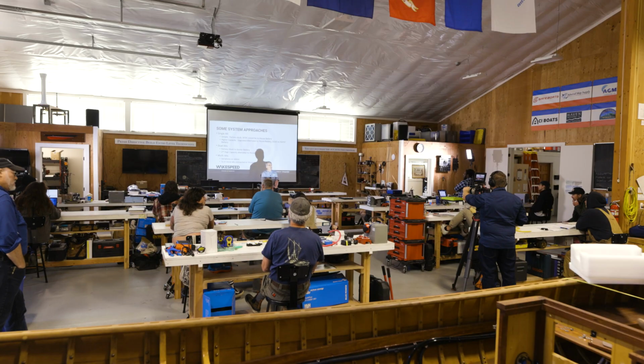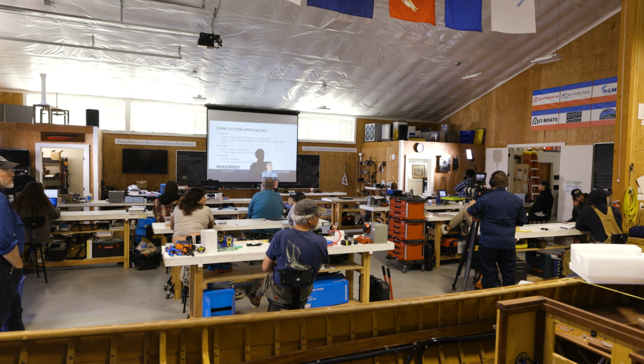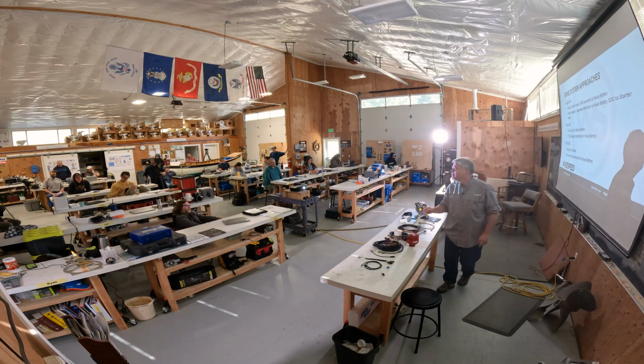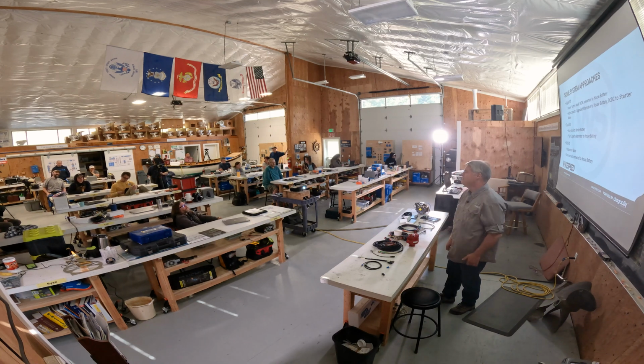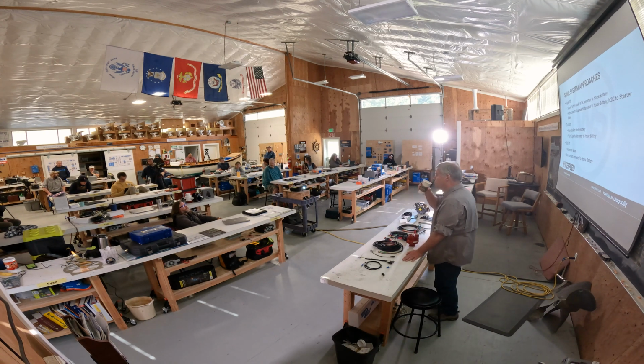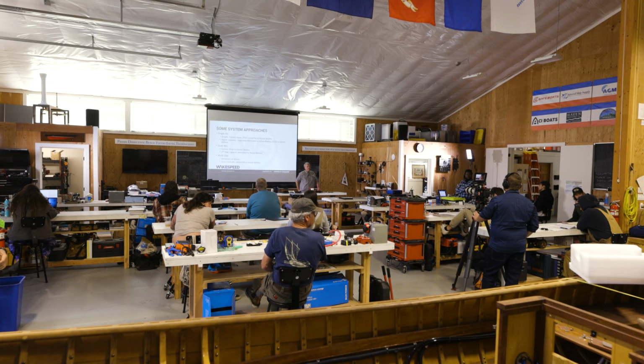And Rick, do you have any insight as to what to consider when picking rib belts in terms of their ability to hold power? I don't know that there's a lot of data out there in terms of what horsepower loads the serpentine belts are going to address. But just from life experience, a six groove serpentine, which Yanmar typically has installed from the factory, they're very comfortable with about a 200 amp alternator.